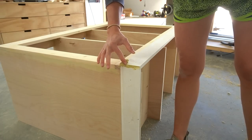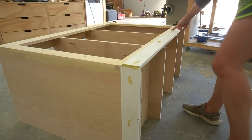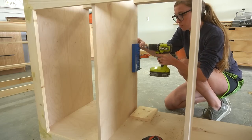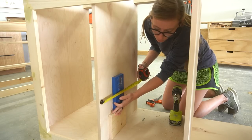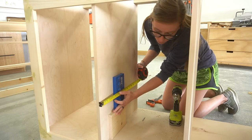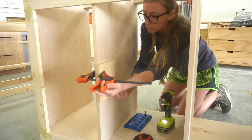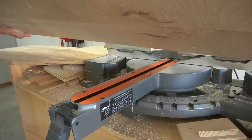I used some wood filler to fill in the nail holes and to smooth out all of the joints. Next, I pulled out my Kreg shelf pin jig and drilled shelf pin holes in the three cabinet sections to install adjustable shelves. I used some scrap wood blocks to help me space these holes where I wanted, and made sure that the front holes were just a little under 14 inches from the back edge, since I only made my shelves about 14 inches deep.